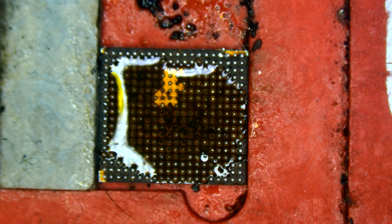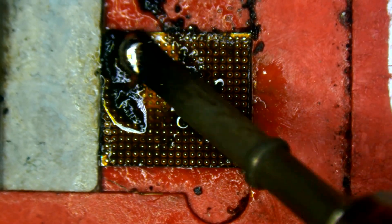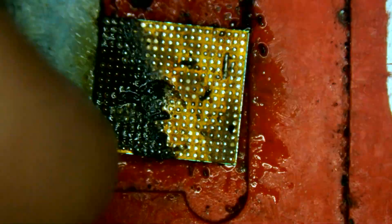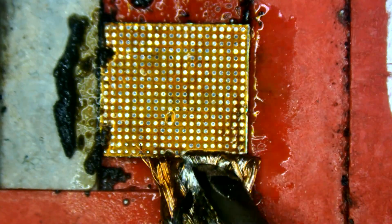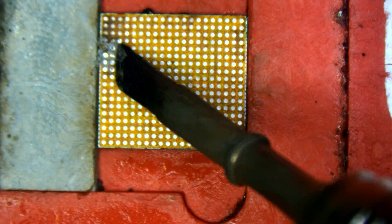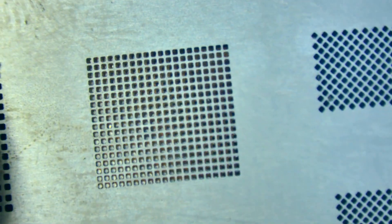Moving on to the IC itself — if you're going to reball it, you'll need to clear away the underfill if any, and replace all of the solder. Adding some low melt solder will help in this process by mixing with the factory solder. What I like to do is take an iron tip with a chisel blade and carefully skate across the surface of the IC to remove the underfill. If you push too hard you might scratch the surface of the IC, in which case you'll need to replace it. For the PMIC, I like to use a higher melting temperature solder like 183; you could even go up to 217, but I find 183 is just fine.